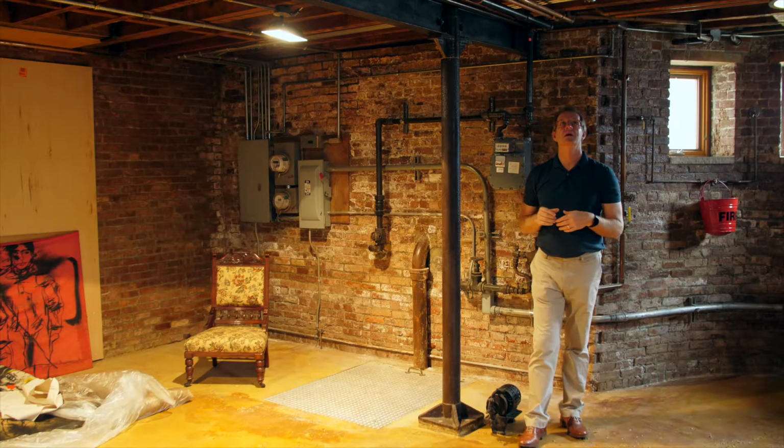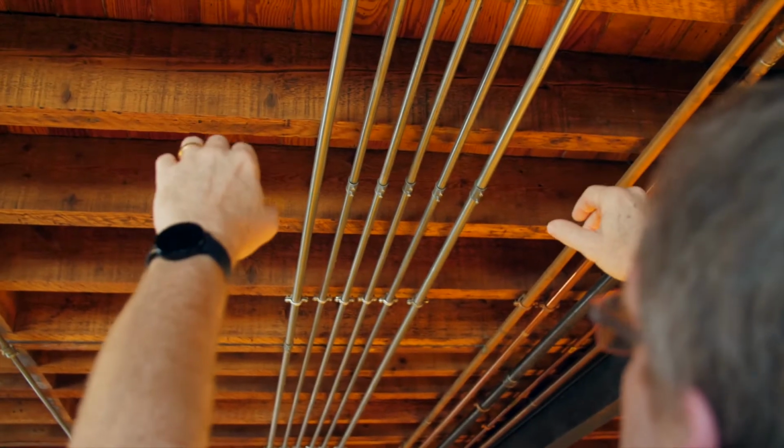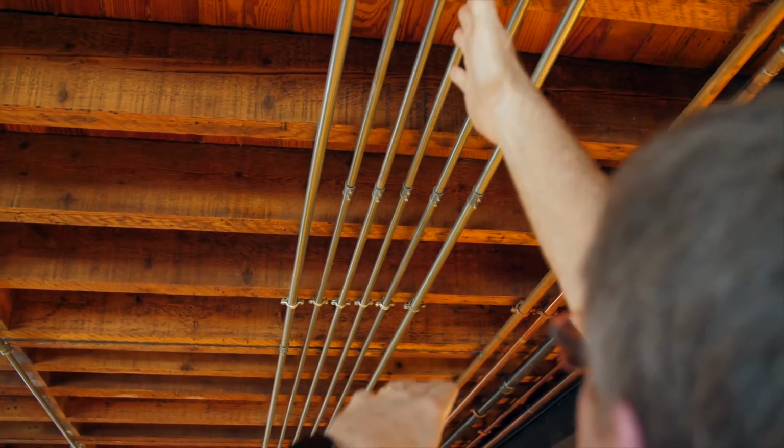As I look around here, I see this beam here has a crack running along with the grain. It's alarming at first, but as we spoke about, wood dries out, and as it dries out, it cracks. It's fine if it's going with the grain. The issue is, if you have it going across the grain, so it's breaking this way, that beam is gone, it's lost its structural integrity, and that's something you really do have to pay attention to. That you cannot let go. You want to get a contractor in as soon as you can to address that.